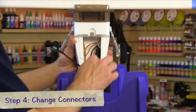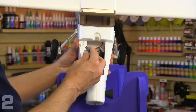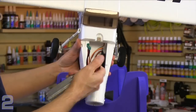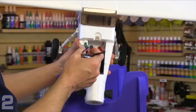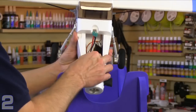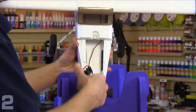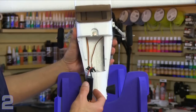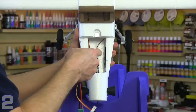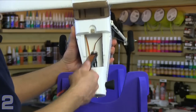A little pre-planning: if you look at the ESC and the connector that ships with it, this is an M6 connector — not terribly popular with a lot of battery manufacturers and kind of hard to find in the U.S. We're going to replace it with a Dean's Ultra plug so we can use our library of compatible flight batteries. Pull the ESC off the hook and loop tape. Note the wire connections — if the motor goes in the wrong direction, just swap any two of the three connected wires to reverse direction on the ESC. We'll try our luck when we put it back together and switch two wires if needed.